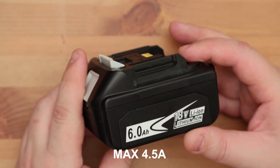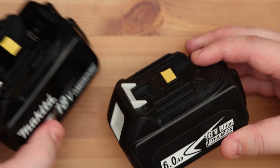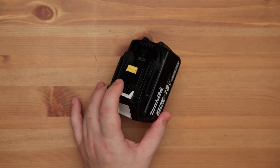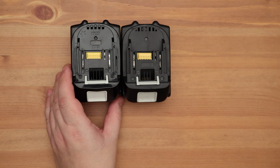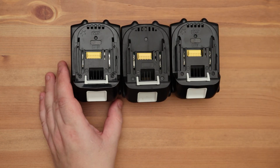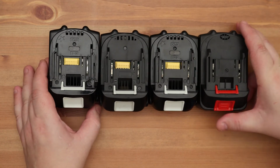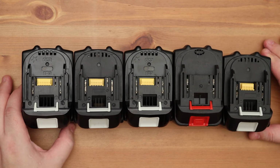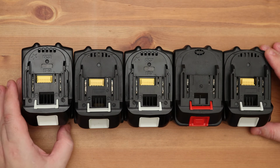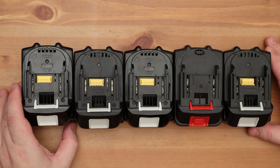This applies not only to Chinese batteries. This manual is also suitable for the operation of original batteries. After all, we must remember that any battery loses its capacity over time. It is advisable to sometimes test your battery and charge it with the current that corresponds to its real capacity. That's all I can tell you about setting the charge parameters. We start the process and go to perform our other tasks.